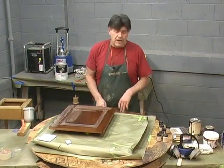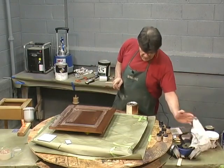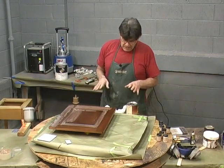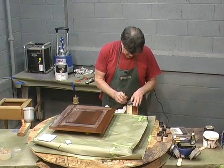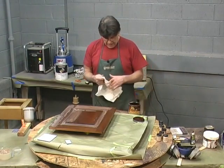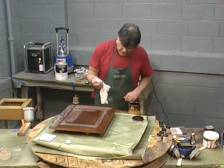What do you do when you get that? Well, we've showed you a lot. I'm going to tell you one more time. Here's an instance where we've got a coat of finish. Particularly if you've put an oil on this, you kind of got a problem, and that is that oil is going to seal it off. Sometimes, a lot of times, so will a solvent base. Water base is usually a little bit more forgiving.